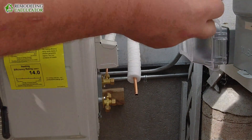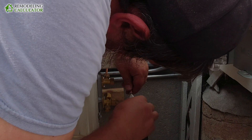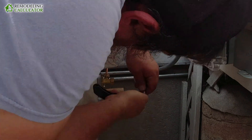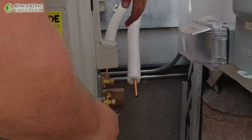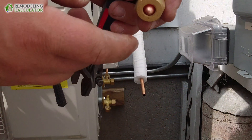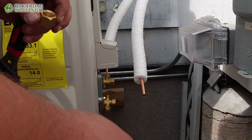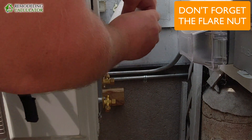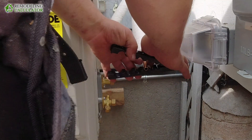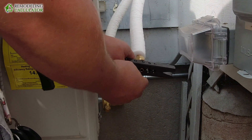What I do next is just with the tip of my knife, I remove what the deburring tool did not remove. Just be very careful with it. There is a piece of copper sticking out of it — that makes sure no dirt or air goes into the valve. Three-eighths — again, just one-eighth of an inch sticking out, no more but no less either.